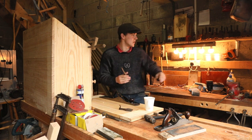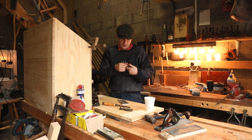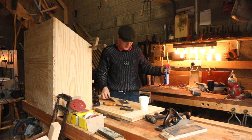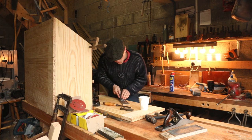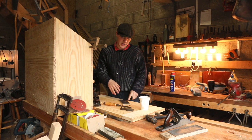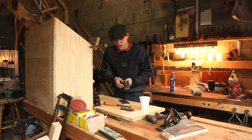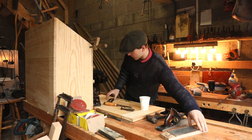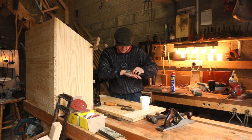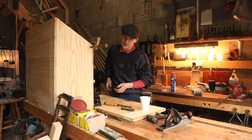What we need is a screwdriver and I don't think we can find any, so we're going to commit the mortal sin of using a blunt chisel. I have a diamond stone in here as well, so we're just going to bring this up to a thousand grit, get her good and sharp. I'm going to use some WD-40 to oil up the diamond stone and then just go like this for a quick while. One of the best things you can do for your woodworking skills is learn how to sharpen freehand. I used to use jigs and honing guides to get these angles sharp, but now I'm not too worried about getting it perfectly sharp every time — once I can reasonably match 30 degrees and strop it nice and good afterwards, I've been able to get an edge I'm perfectly happy with consistently. When you have to worry about honing guides it just makes the whole thing more of a pain so you're less likely to do it. As little hair as I have left on my arm, it's doing a grand job taking it off, so we're going to fire away and see if we can get this thing reasonably flat.